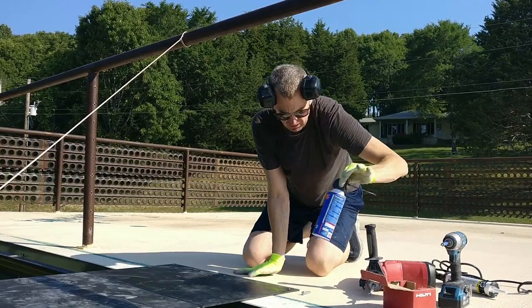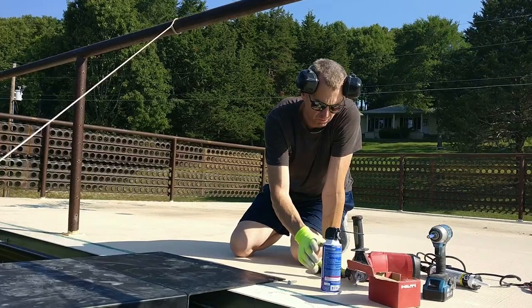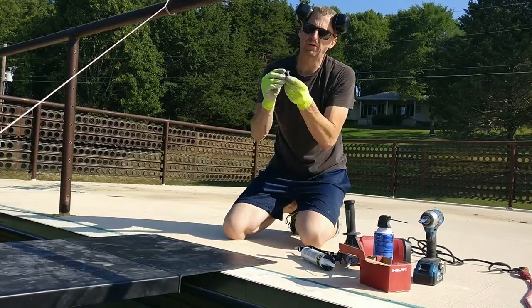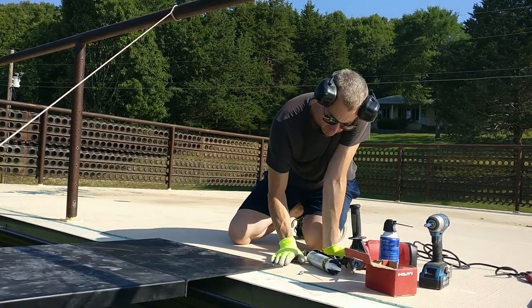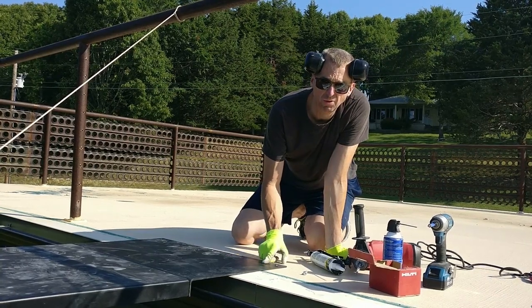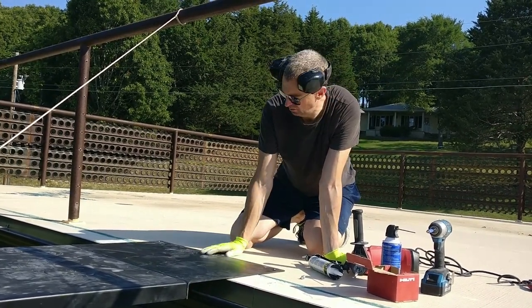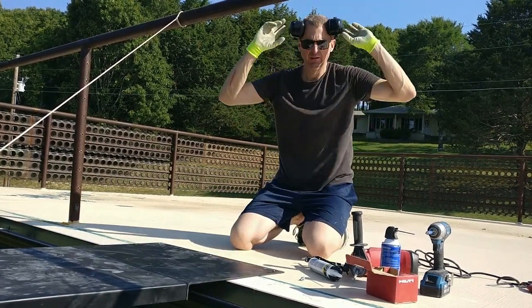And then what I use is our little can of air, and I will squirt, push that down in there and blow the air out. Works really, really well. And then I'll put a little bit of caulking in the hole, so when I run that screw down there, the caulking will end up at the top to seal it so that we don't have any water. If it migrates under, this plate has been primed with that nice chemical primer and then painted even on the underneath side so that it doesn't get any rust. So let's start.